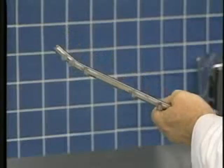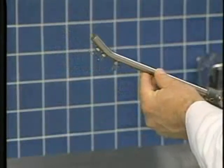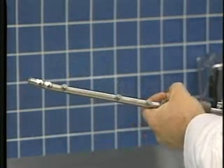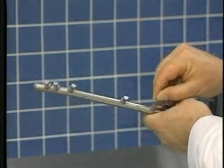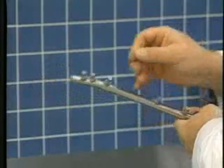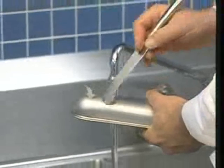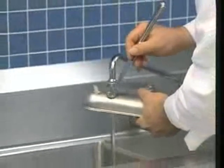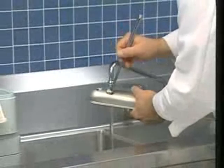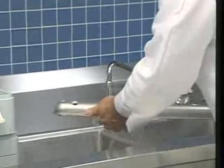With the wash and rinse arms removed, check the nozzles for debris that would block the flow of water. Over time, rinse arm nozzles can be blocked by a buildup of lime. If rinse arm nozzles have become blocked, use a straightened paper clip to clear the hole in the nozzle. Repeat this procedure for any other nozzle obstructions. Occasionally, wash arm nozzles can become obstructed with food or paper debris. Using a toothpick or dull-bladed knife, push the obstruction into the wash arm. Then thoroughly rinse the wash arm under running water until the obstruction has been flushed.